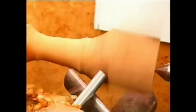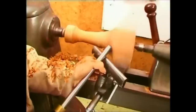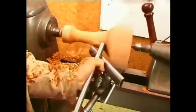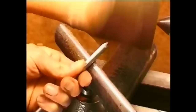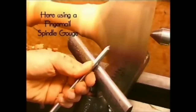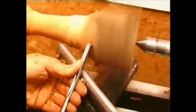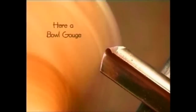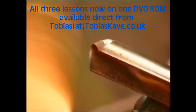Cutting this area smooth is more difficult, as the tool drops into the gaps as they come round. A simple move of the tool rest can improve control dramatically. Remember that the key to control is holding the tool back so that it doesn't drop into the gaps. Trying to hold the tool forward against the kickbacks does not work. Grip the tool firmly with your top hand. Keep that hand against the rest, and swing and slide the tool bevel on around the curve. This sort of chatter control is covered in detail in my other lessons. It is of great importance in bark-edged work as well as in multi-centre work.